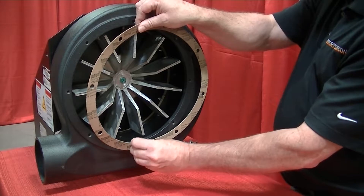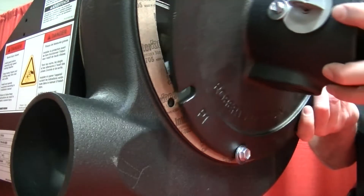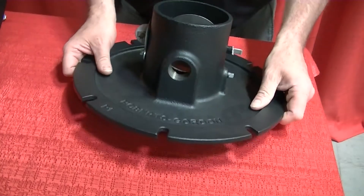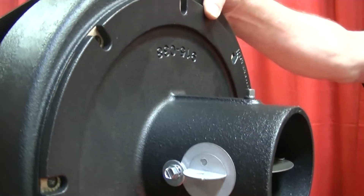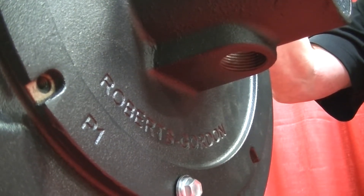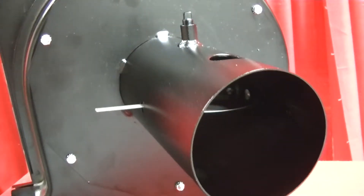Position the mounting notch to engage with the previously installed bolt on the inlet assembly. Identify the one-inch hole and be sure to always have this located in the down position — this hole is for the installation and connection to the condensate line. Note: EP 100 and EP 300 pumps do not have this option; other methods will be required to properly handle condensation.